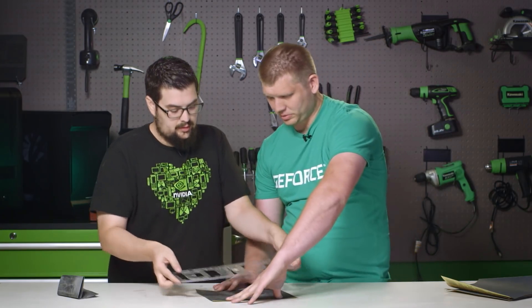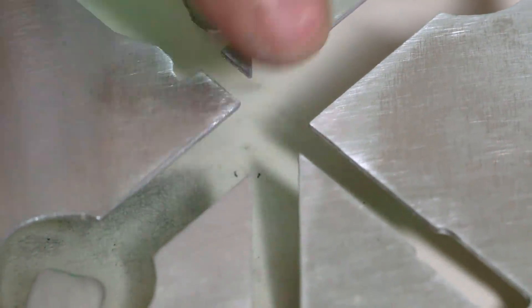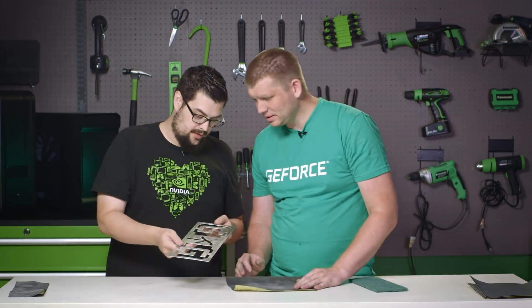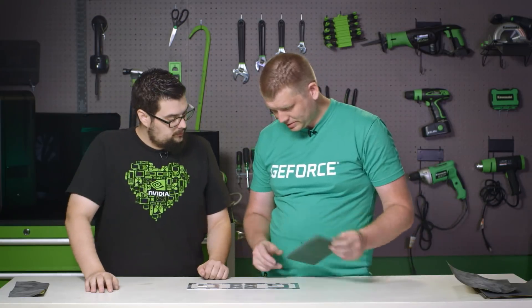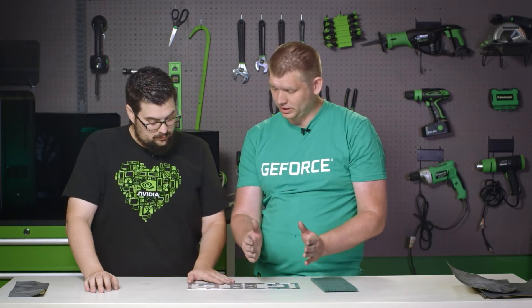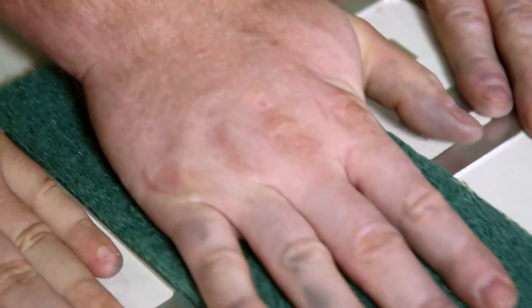After sanding, we should have a pretty smooth, even finish — just a nice even satin. Then we move on to the finish step with a green Scotch-Brite pad. It's pretty forgiving on how carefully you have to move across the piece to keep an even brush finish. You can do multiple passes until you get the texture desired, but you need to stay exactly the same technique each time so you don't get lines crisscrossing.